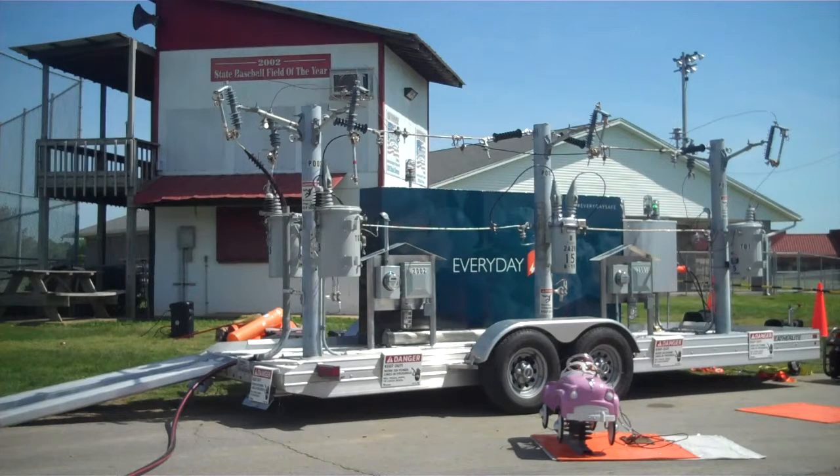Like I say, we got working inside here. We have several layers of protection. We have our hard hat, our safety glasses. We have our flame retardant clothing. We have rubber gloves. He also has rubber overshoes and is standing on a rubber mat. So we have several layers of protection in here. So whenever y'all ready.